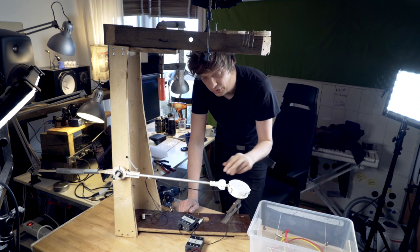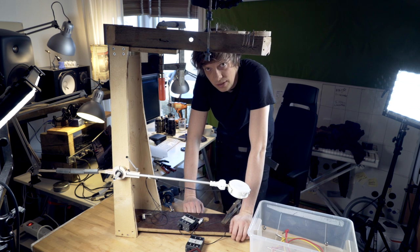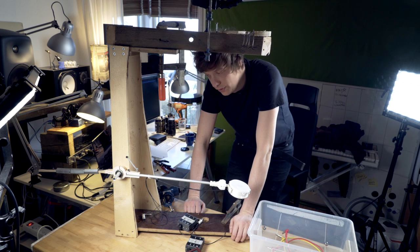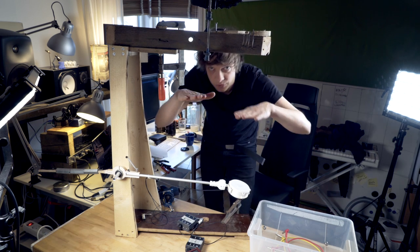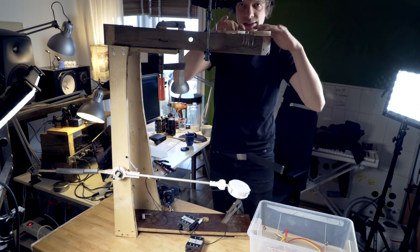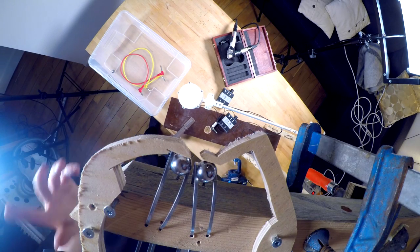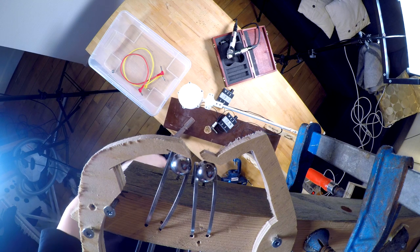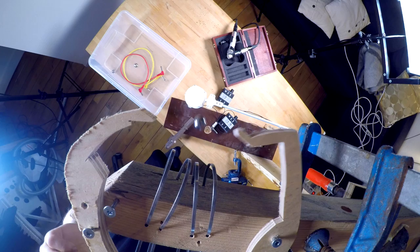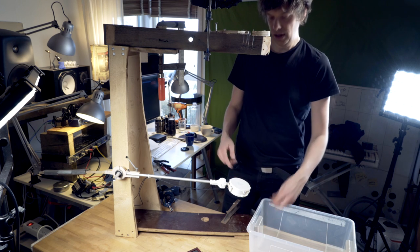We have a test setup finished. I want to try the movement first, because I want a very specific movement of the drums when they're hit — only for visual and aesthetic reasons. I want the audience to be able to see which instruments are playing, and I'm also quite inspired by anime music videos where all the instruments always jump very nicely. I have a spring here and an adjustable counterweight here. Up here is also a very important test: a place for two marbles to be released individually that I hope can hit the same spot — doubling up the channel, so two marbles on different channels play the same instrument. The plastic of the top layer is too thin, so this leads to inconsistent jumps. Thicker top layer needed.